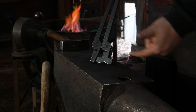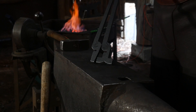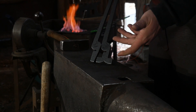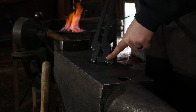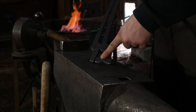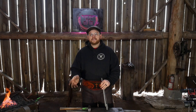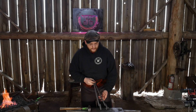These are going to be box jaw tongs. We are still going to be twisting them — they're still twist tongs — but they have a different caveat because these wings here are entirely too thick to bend up at a right angle. So we will have to do some thinning down there, which is a bit trickier on the forging side. I hope to show you an easy method of thinning those out and turning them into nibs that stick up to hold your square stock. Without further ado, let's get these in the fire.